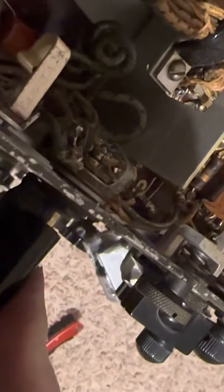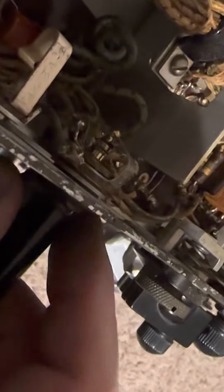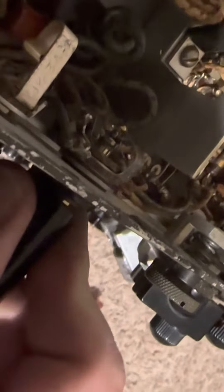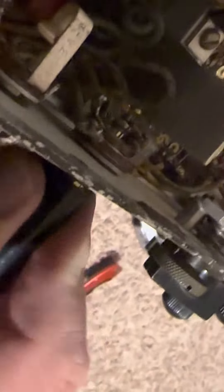I put the radio back together and it turns out the BC654A microphone does use a tip connector. If you look at the connector, the tip is used for keying the radio. I had the wrong plug in here and it really bent up the connector, so you want to use a tip connector just like that — make sure the connector is shaped correctly on the BC654A.